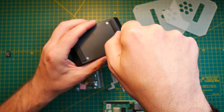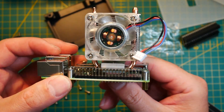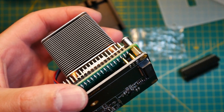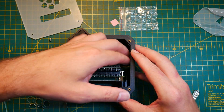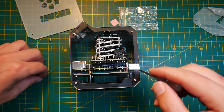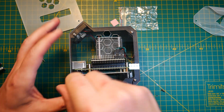The process isn't complicated and if you are me, you can complete this in about 15 minutes — if you are yourself, probably 10, because you're going to read the instructions and not make the same mistakes I did. The first thing I had to redo was just turn the heatsink around 180 degrees, because I wasn't paying attention and it will get in the way of the header and the acrylic sides. If you went for the UPS or M.2 addon boards, make sure the pogo pins are properly aligned and not bent. Also, add all the connectors onto your header before you mount the acrylic panels. Lastly, the acrylic isn't shatterproof, so take extra care and do not over-tighten the screws, because you may crack the acrylic and ruin the beautiful final look.